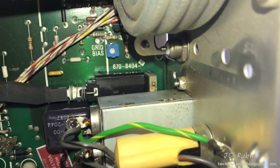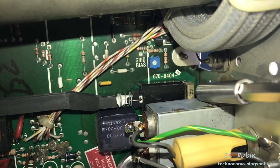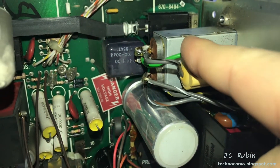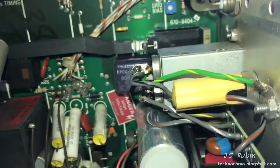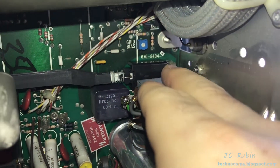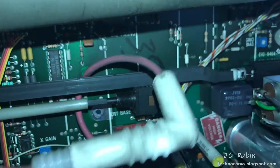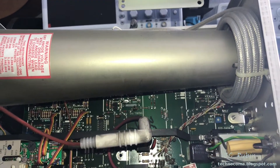I've removed the metal cage from the power supply so we can see the capacitor I was referring to. This is completely de-energized, hasn't been turned on in a year. We can see this X2 capacitor way down here in the back by the power switch, and the only way to get to it is by removing the power plug and fuse assembly — all of that had to be removed to get to that capacitor. That work has since been done. All of the grime has been cleaned off the circuit board, though you can still see some soot on this cable that goes to the CRT from that event. Everything else is cleaned up.